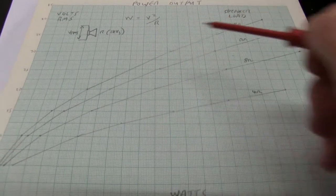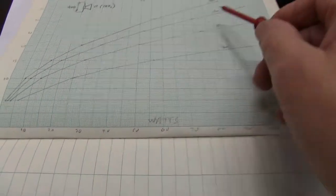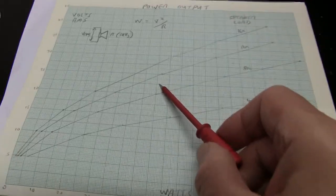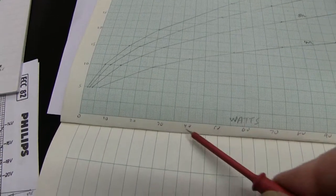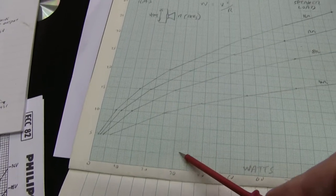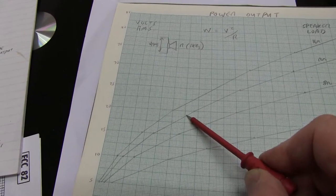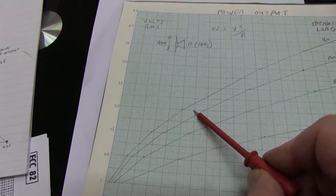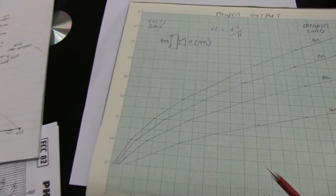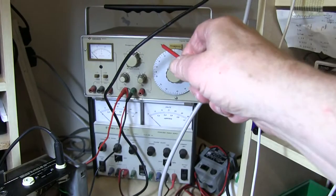It's V squared over R, so rather than keep calculating, I can just look on here. I've just drawn this graph. So with a 12 ohm load, say we're looking at watts along the bottom, say about 30 watts. Going up to the 12 ohm line, we're looking at getting on for 20 volts RMS across the load. So I've connected up the voltmeter there,